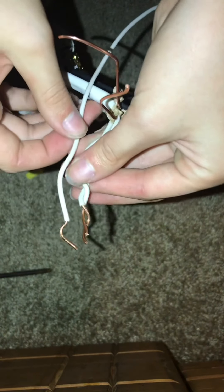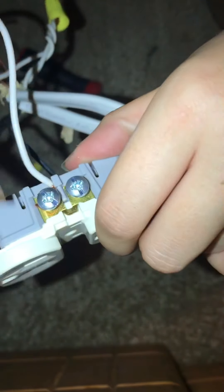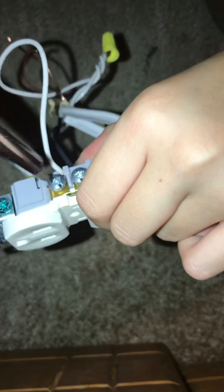Next I'm working with the white wires, twisting them together to get them ready for the pigtail — making sure they're around the same length so it's easier to put inside a wire nut. Then we add the next wire onto the pigtail, lining it up so it's easy to wire-nut. Now I'm wire-nutting the three white wires together — takes a lot of twisting, my thumbs hurt after this. Then I looped the end to go on the silver screw and screwed it in tight.